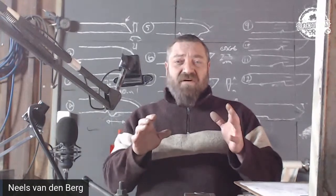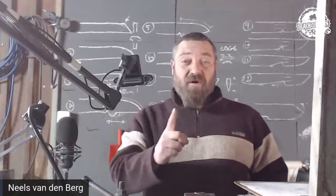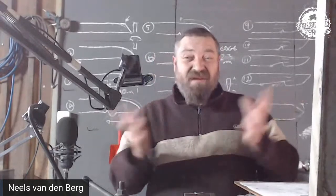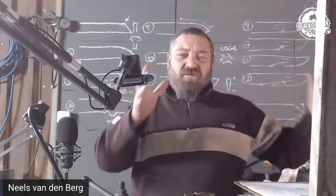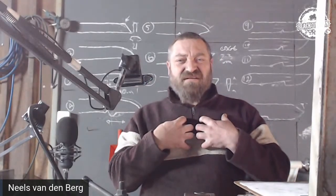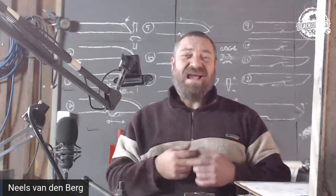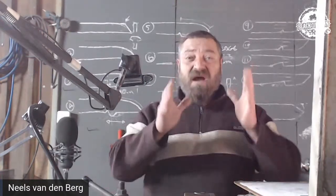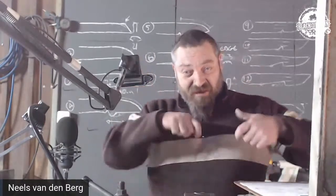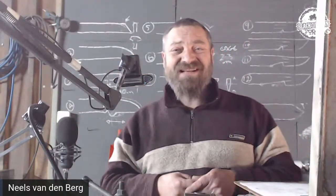If I've got 4 or 5 wheels on a grinder that I need to use to make one single project, and I'm going to be using all 5 of those during a production run, say a mini production run where I need to do 3 or 5 or 10 or 20 of that specific knife, I own 9 grinders for that reason. I hate changing tools. I hate it. There's so much time wasting. So I will set up 5 grinders in a row and create a production environment where I can do one grind, move over to the next machine, do the next grind, and step it up. So that saves you a lot of time.